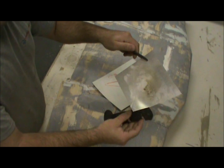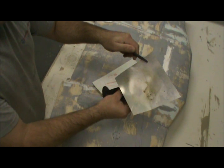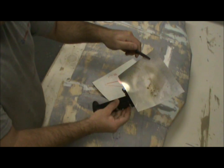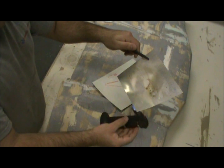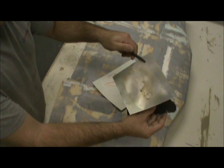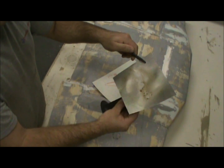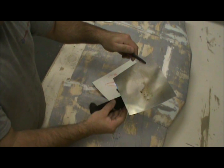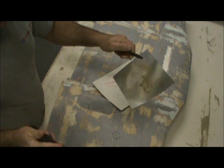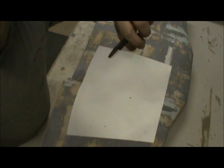You'll notice all the smoke coming off. This is why I don't like the dish soap method. It works very well to give you an indication of what color the metal needs to be, but then you have to wash the dish soap residue off. You can also see the panel warping as you heat it up, because you're not heating it very uniformly. That's the dish soap method. On the back side, it takes on a pinkish hue.